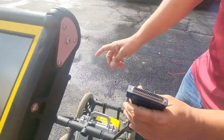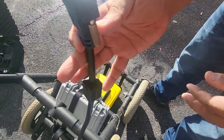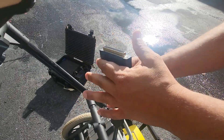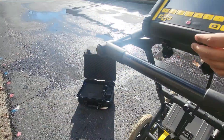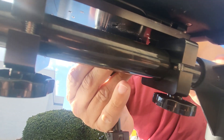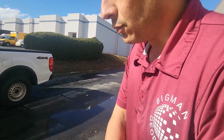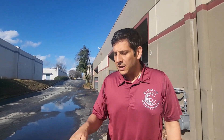This is the data collector. The antenna is down here on the bottom. The neat thing about the Findar LMX 150 is it's a 500 megahertz antenna. All of the rest of the LMX series are 250 megahertz — those have been around for a long time. This is a newer system that went up in frequency to give you a clearer, crisper picture of the subsurface. Higher frequency means better resolution, but it won't go as deep as the old LMX 100 and 200.